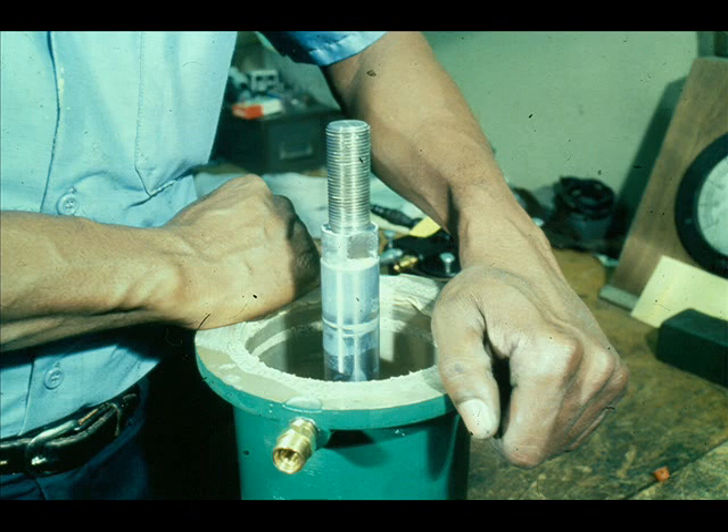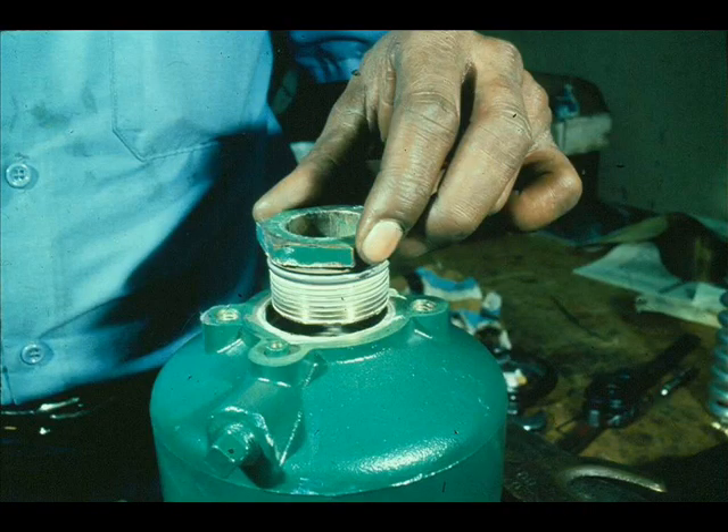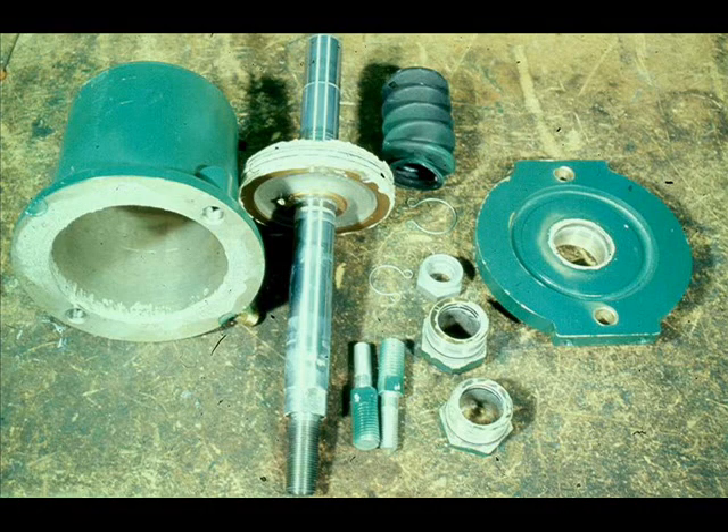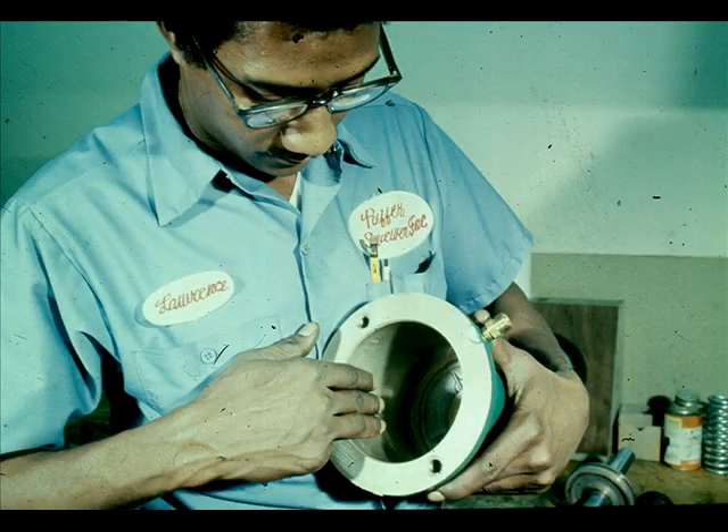Force the piston out the open end of the cylinder. Unscrew the cylinder seal bushing and the yoke seal bushing. Inspect all parts for signs of wear or damage and replace any defective parts. Examine the cylinder walls for scoring and excessive wear. If you suspect excessive wear, have the inside diameter of the cylinder mic'd. If it is worn badly, replace it.